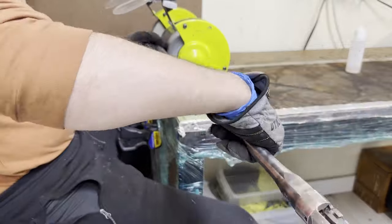After letting the stock dry after degreasing, it's time to sand. I use a sanding block to ensure even pressure and start with 120 grit, then moving up to 220 grit and then 400 grit. You'll notice when progressing up with each grit you'll be using more. Before I would use 800 grit loose, but I ended up purchasing an 800 grit sanding block, which makes it much easier, and then I use a 1000 grit sanding block. Next I do some steel wooling — starting with a more abrasive steel wool to penetrate any missed crevices, then finishing with zero grade steel wool, which makes the stock super smooth. This is one of my favorite parts of the restoration as you're able to see the stock come alive and back to its former glory.